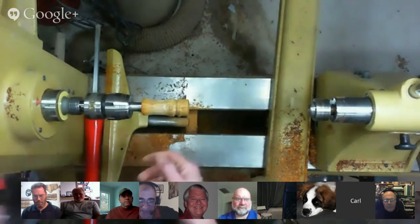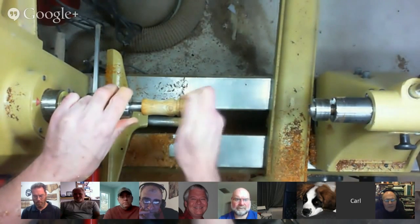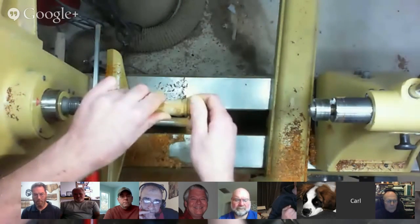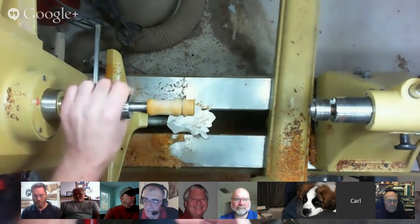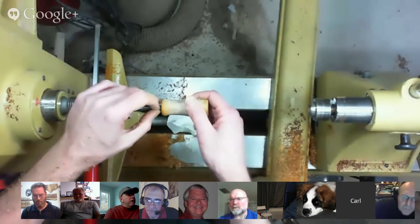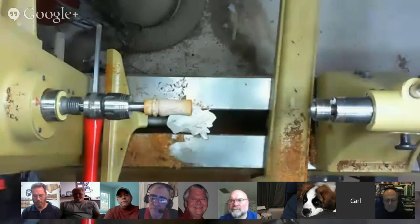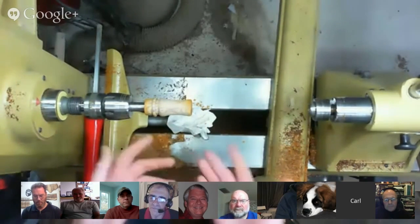If I can find the things. All right. That's pretty close. So that's what I do with the duck calls. Like I said before, I reverse the lathe and sand back and forth. But with these, just flip it back and forth like that and go through the grits, and it works out great. You're going to need to sand both ends anyway, so there's no need to reverse it.